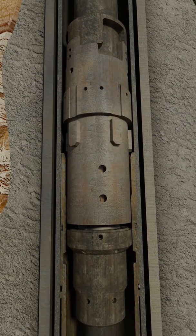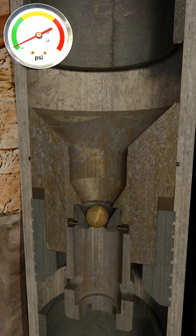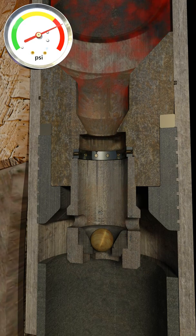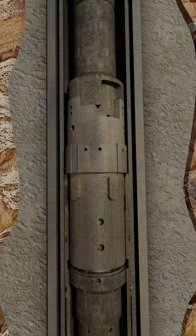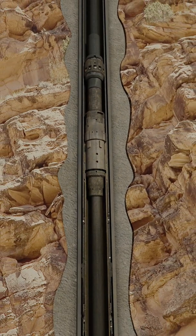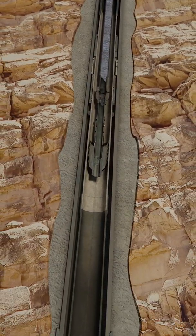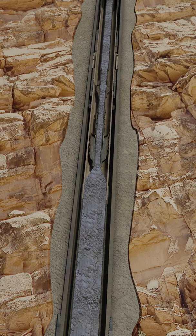The HRDE setting tool is lowered to prepare for cementing operations. Pressure is increased again from surface to shear the ball seat in the Type 2 landing collar, and circulation is re-established through the liner shoe. The liner can now be cemented. While keeping the running string in compression, cement is pumped down the drill pipe and into the liner. The RS pack off forces the cement down the inside of the liner, out the liner shoe, and into the annulus between the liner and open hole.